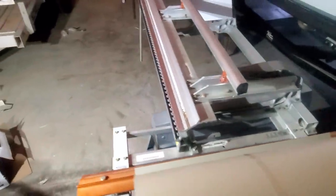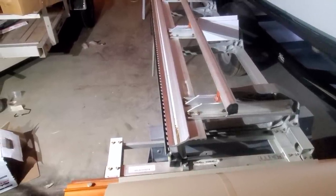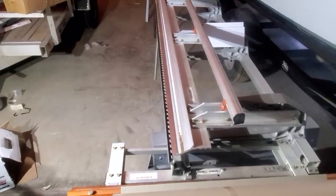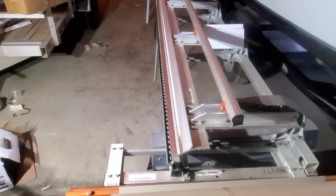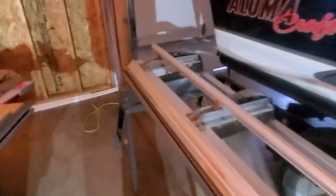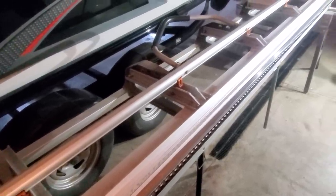But we needed it to break some pieces of flashing for the drip cap, and then for under the edge of the siding. As one subscriber had made a comment about, make sure that we plug it up. We're going to use some brake metal to run along the bottom edge to stop any mice from crawling up or any other bug from crawling up in between the gaps in the siding.